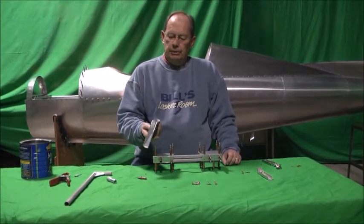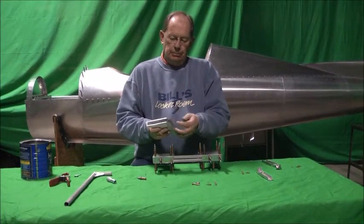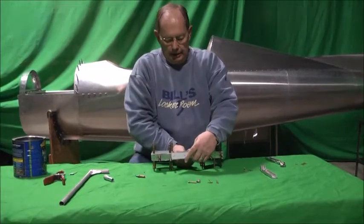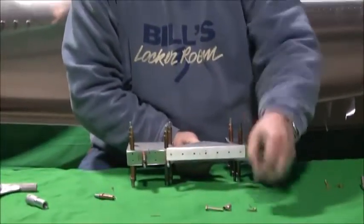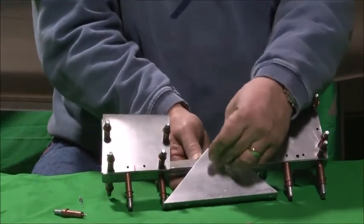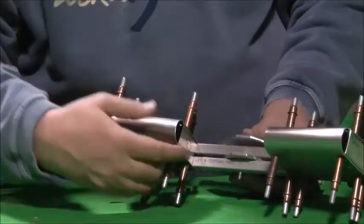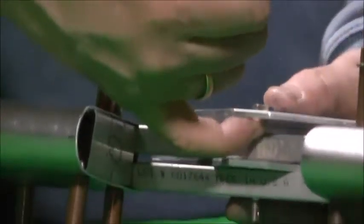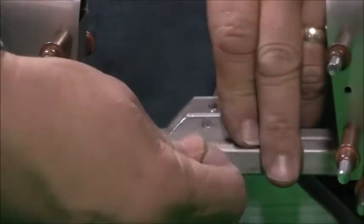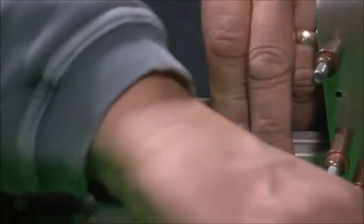This is basically a piece of 1x3 square tubing that we've cut the shape of — cut this front piece out, the edge of the material. A bolt and spacer will go back in there, but to start with, this just gets slid on. There's a spacer required. You can see we've got a stack of washers — it's time to stack the washers in there to get that spacer in. This gets folded together. Of course, it gets a washer and a castle nut because this is going to be pivoting, and of course the cotter key when you're all done.